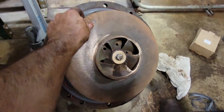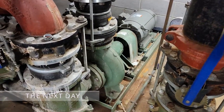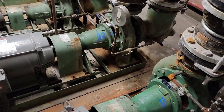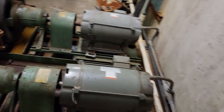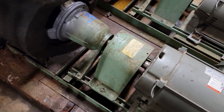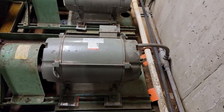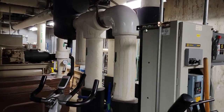We've already spun this and made sure that everything feels free. I already took out the ports and used a whole tube of electric motor bearing grease and filled this thing up. It's been one day now — this one here is not leaking; that's the one we first did, we're looking good on that. Going over here to our other one, everything's cleaned up, touched it up a little bit where the paint was missing, and we're not leaking on that one either. All the braces and shields are back in place, the bearings are greased.